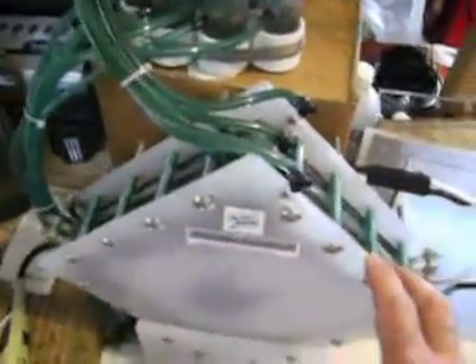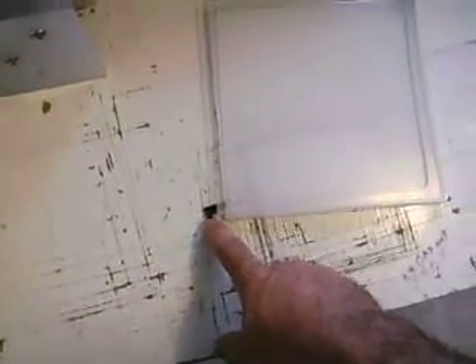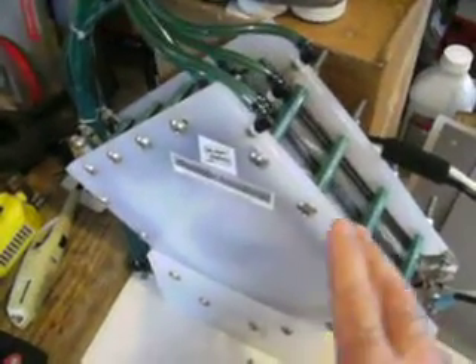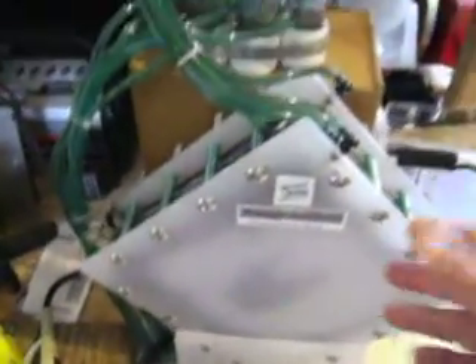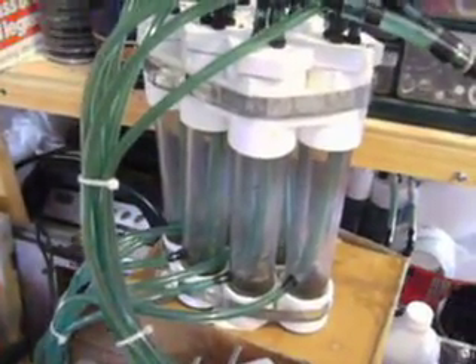I chose polypropylene because it is a lot easier to drill than acrylic, and with these complicated holes, cracking can become a reality. Number two, this stuff is way cheaper than acrylic — about half the cost. I don't need clarity either, because there is no liquid level in the cell body; the liquid level is up in the clear PVC which is away from the cell body. There is no worry about temperature, and as you've seen from my efficiency video, this cell design runs way cooler.